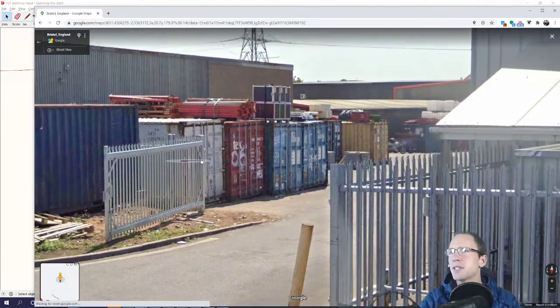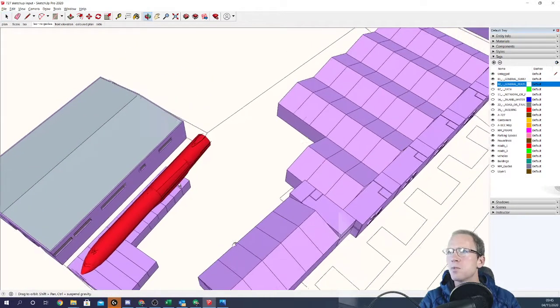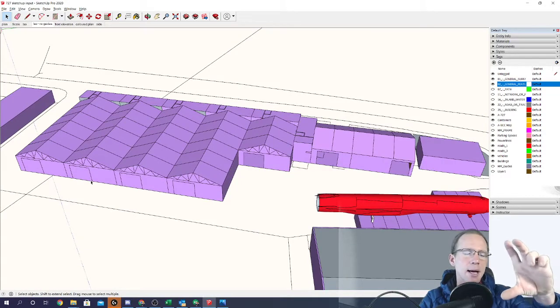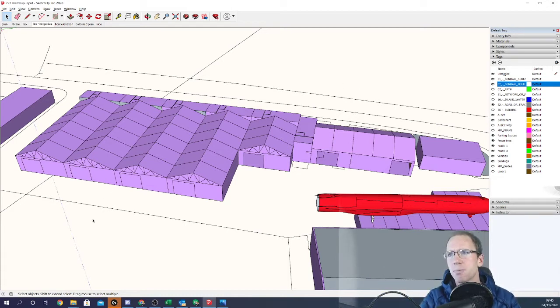Next is the services — this is the big one. We need to get conduit in there for waste water, electrics, data, and whatever else. I'm thinking we run two options: one is we run ducting from unit 21, not just conduit but a proper dug pipe, so we can run cables from unit 21 along the back of all the warehouses, across past the Virtual Venue and VVX, and then across to the aircraft — with manhole covers all the way along so we can draw cables through. I'm thinking a four-inch or six-inch pipe so you could even run a 32-amp three-phase through if needed.